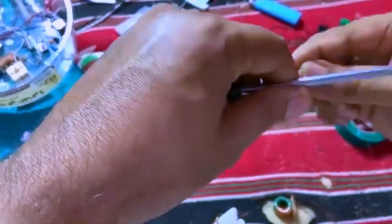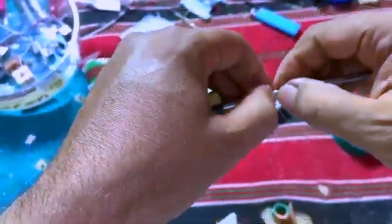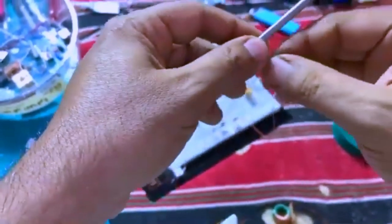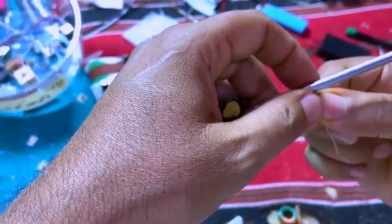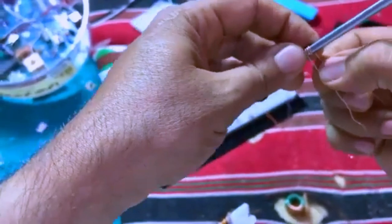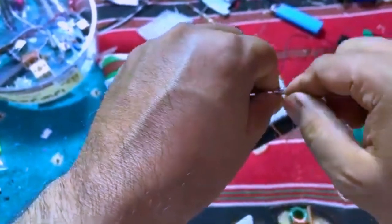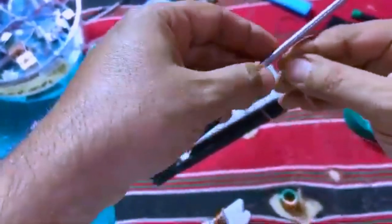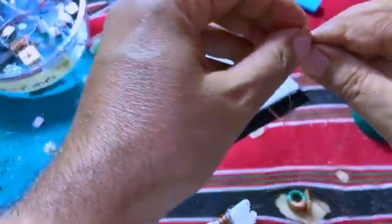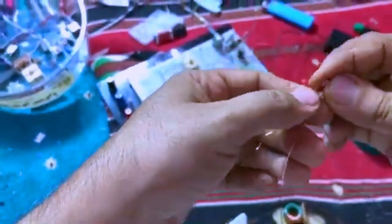The diameter of both coils should be five millimeters. Find any rod that has a diameter of five millimeters — this screwdriver is five millimeters in diameter, so we are going to use it as a winding base. Wind the wire three times for the three-turn coil. The length would be six centimeters. Or if you make the other one to have eight centimeters in length, you will finish with a beautiful RF coil.